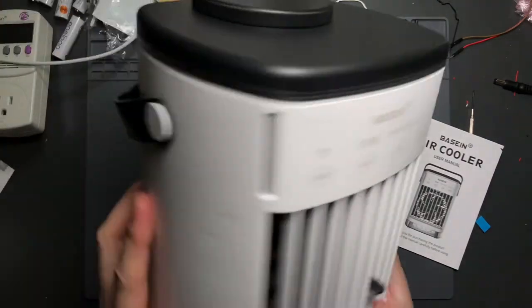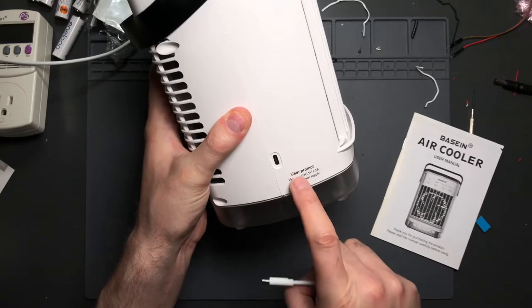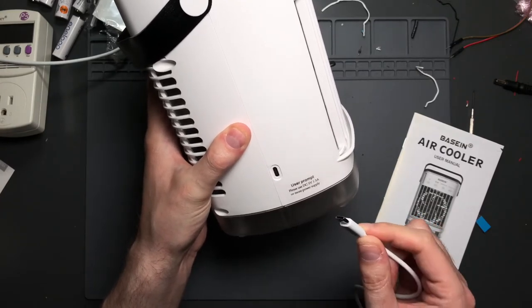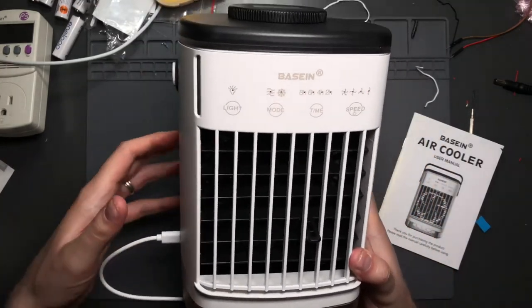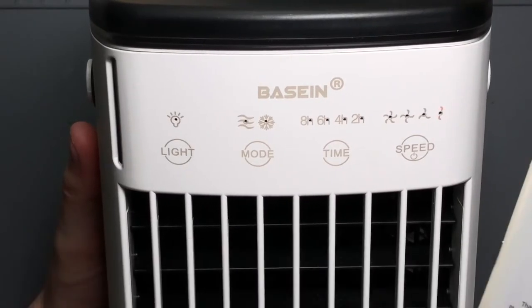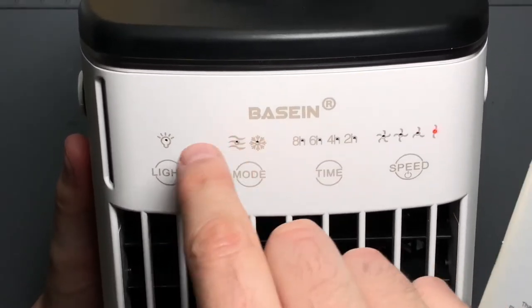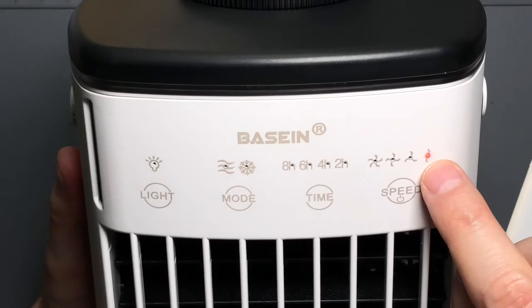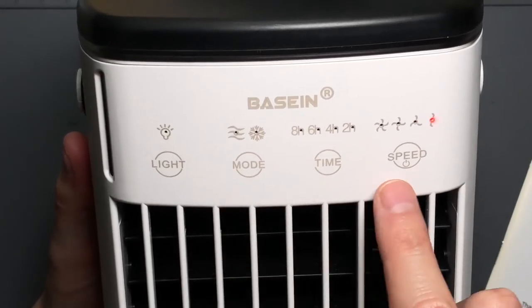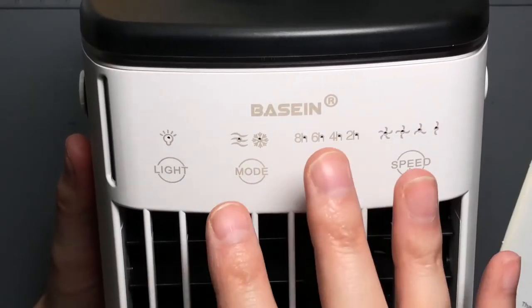The power button is on the side. There's a user prompt on startup — it says please use a 5V 1.5A or more power supply, because below that it will collapse the power supply. Once powered, you can see it's PWM-ing the LED to save energy. The implementation feels a little cheap — just holes drilled through with the LED shining through, and the overlay on the front is stretched to fit the concave surface.